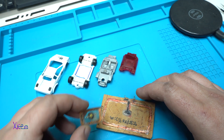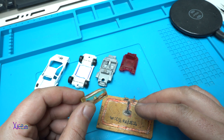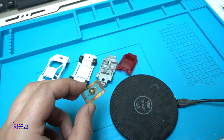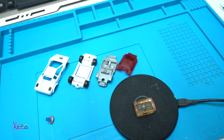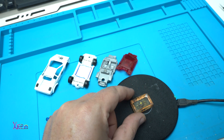To mention: if you make a wireless receiver coil out of a couple of loops of solid copper wire, you can use a wireless charger for smartphones. If you make one and place it on the charger, you will see that it's blinking — that's how the charger works — because this coil is without electronics and is only picking up the signals.